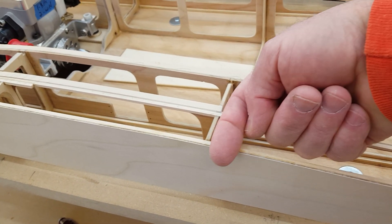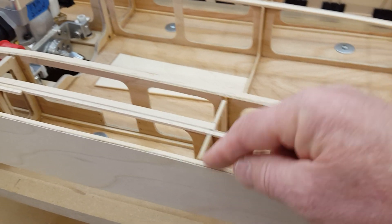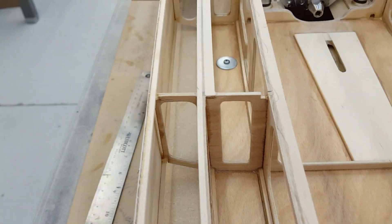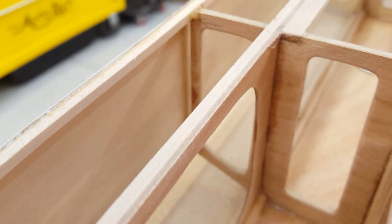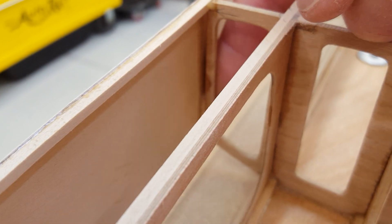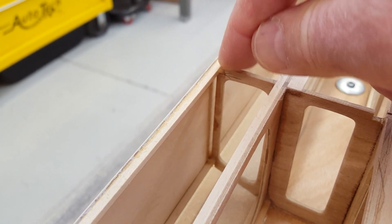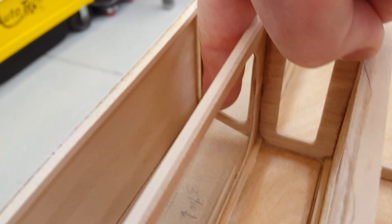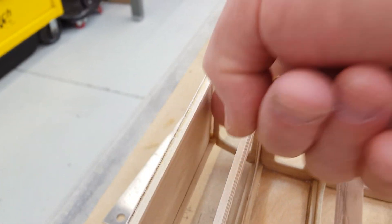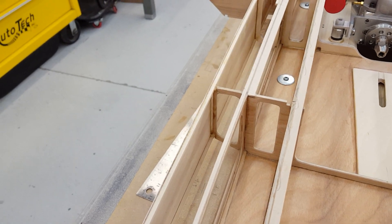If they're pushing out on the piece, we don't install it - we sand this so it's actually not even touching the bulkhead. You can see there's air there. This spot gets only close, then just put a little epoxy there to hold it. Down here we're not going to hold it either, because wood moves and does funny stuff later on.